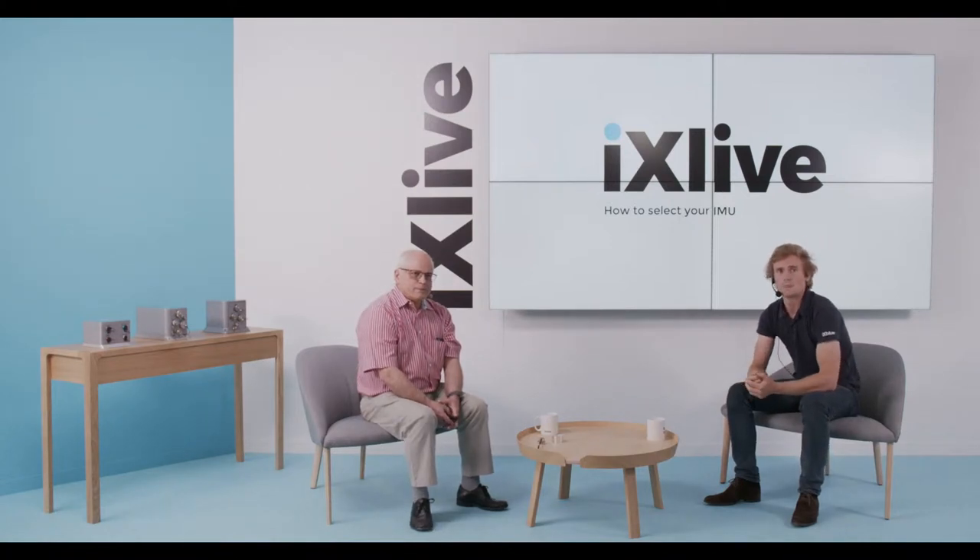So what is an IMU? It stands for Inertial Measurement Unit. There are examples of those IMUs behind me — it's a box that contains three accelerometers and three gyros. The gyros can also be called gyroscopes, rate sensors, and other names you can find in different literature. Choosing the IMU is in fact choosing the right sensors inside the box. You might have a specific mission for your application and will rapidly understand what characteristics you need to match.